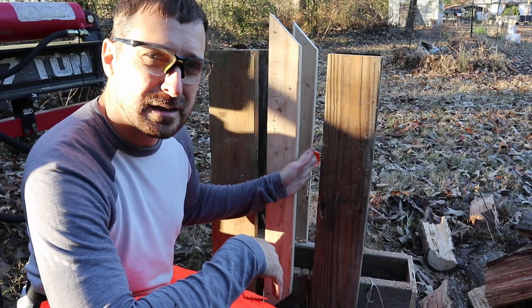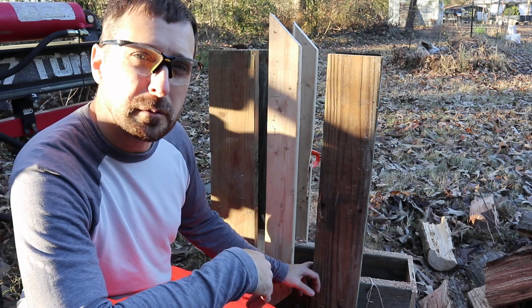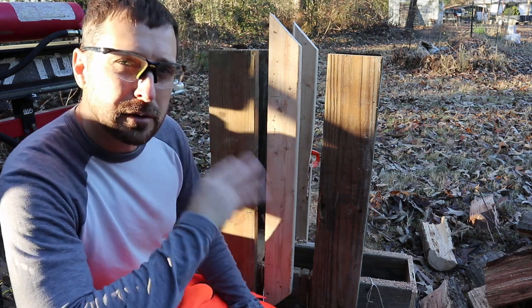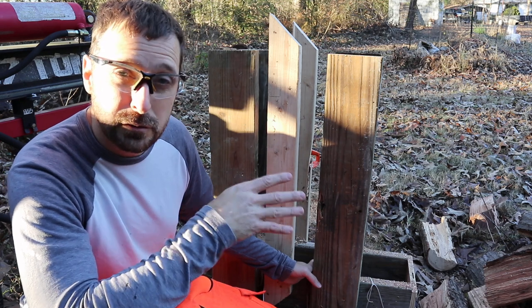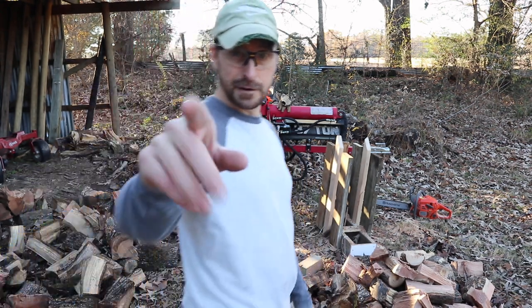As you could see, the saw wanted to pull the firewood pieces toward me, and that's what the sides are for — so you can get a nice cut without it pulling each piece toward you. Also, those pieces of plywood on the bottom prevent the saw from going all the way through. When you feel that bottom piece of firewood release, stop and pull back up — then you're through, so you don't cut through your bottom rails. If you want to put a thicker cross member on the bottom like a 2x4 you can do that. We know this video is going to be helpful for all you small stove owners. Now go check out this video right here which shows you how to start a fire in your wood stove the first time, every time. Have a great day, we love you, see you in the next video, bye!